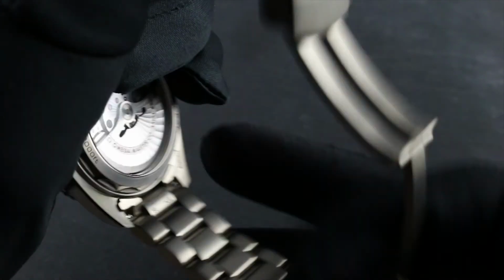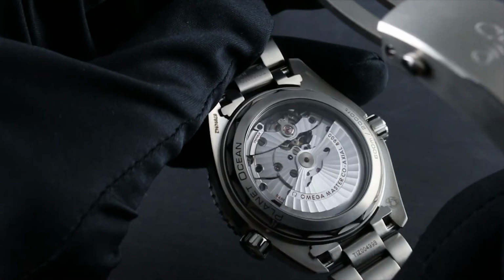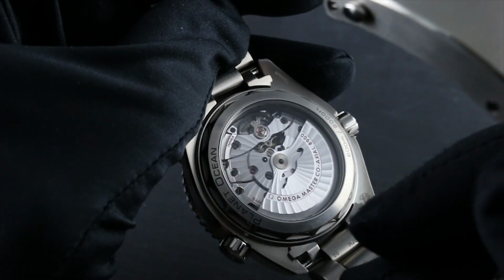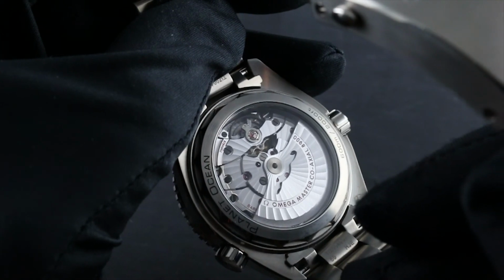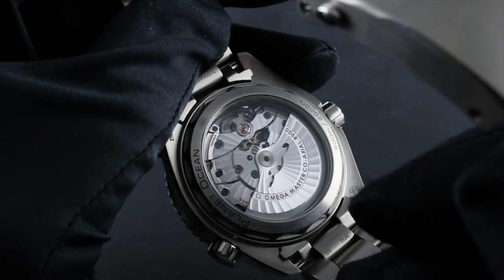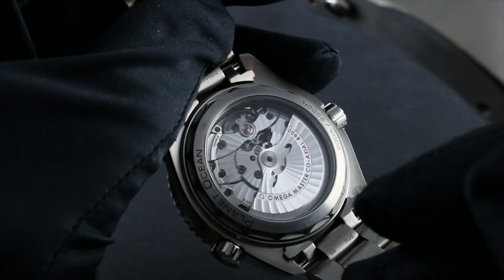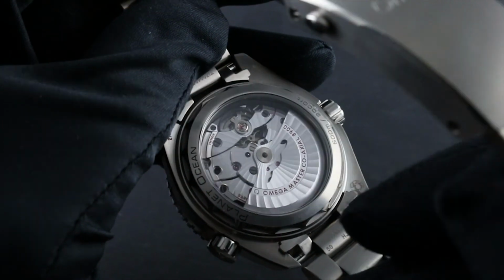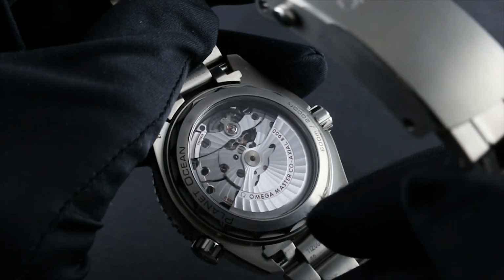Turning the watch over, the master chronometer status of the timepiece becomes readily apparent. Now this is Omega's new and exclusive caliber 8900. You will not find it in any other Swatch Group products, including those of the haute de gamme brands such as Blancpain and Breguet. Now, its calling card is its master chronometer status. That is, it is a chronometer that not only meets the COSC testings, which pertain just to a bare movement, but to the fully cased up complete watch tests of endurance, durability, and precision created jointly by Omega and the Swiss Federal Institute of Metrology. This robust 8-step test ensures that the watch is not just chronometer precise, but dive watch tough.